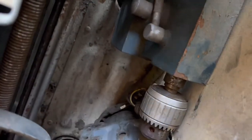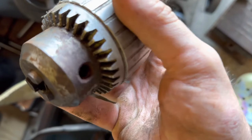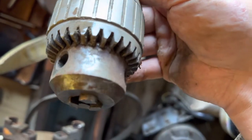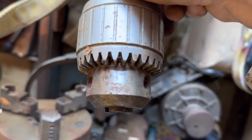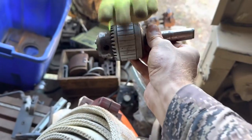Our tailstock chuck backed it up — it's starting to come off. Let's see what we got. Five-eighths — Golden Goose, have you ever heard of Golden Goose? 16 ball bearing, Jacobs taper three. Price that now — you're probably looking at $200 for an American made chuck.